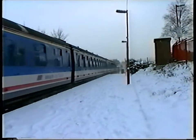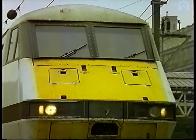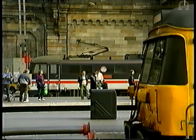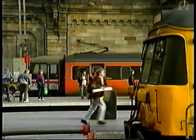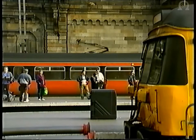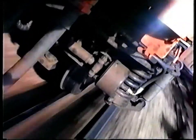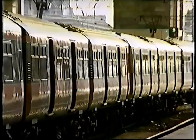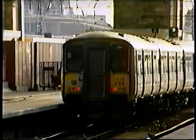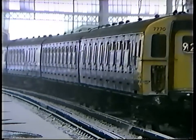Be especially careful when approaching buffer stops. Locomotive-hauled trains comprised of Mark 3 or Mark 4 coaches as well as HSTs must be restricted to a maximum of 100 miles per hour, and all trains which include disc-braked vehicles must be limited to a speed 10 miles per hour below the normal maximum for the line in question. However, this reduction does not apply below 50 miles per hour. Of course, when driving many classes of train, you will be slowing down or stopping every two or three minutes anyway. Always get the measure of available brake power in good time and use that measure in making your judgment of stopping distances. EMU trains equipped with dynamic brakes on power car axles will have this dynamic brake isolated by the engineer during snow risk periods. This ensures that all discs are properly conditioned at each running brake test and during normal service braking.